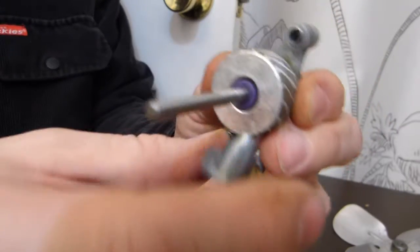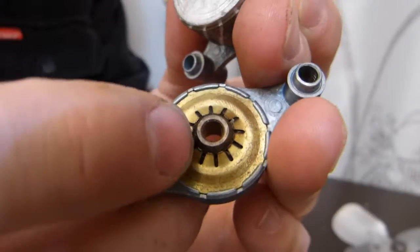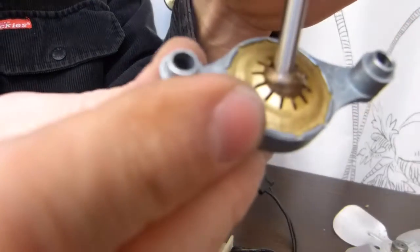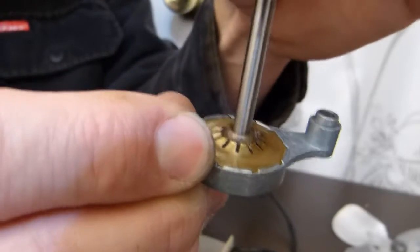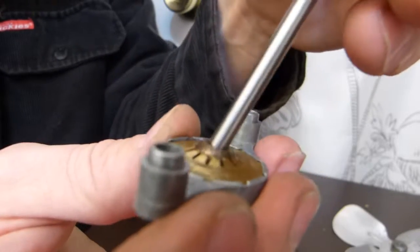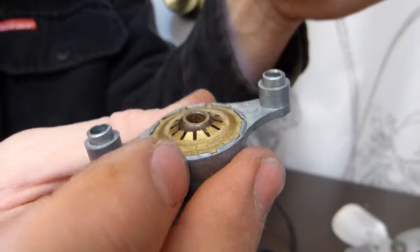This copper color spring plate that you see in the middle is holding in an insert, and this insert can move quite a bit. Don't rip it out. It's possible to snap it back in, but it's a misery. So when you pull the axle out, just rotate it carefully so you're not ripping this insert out of the bearing.